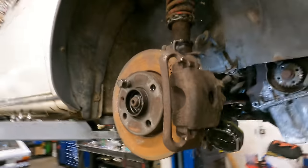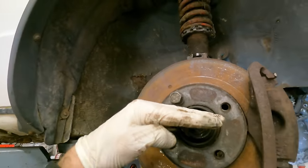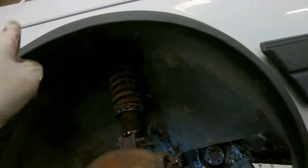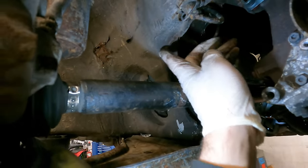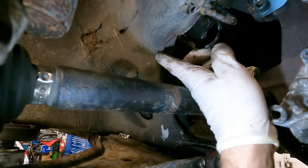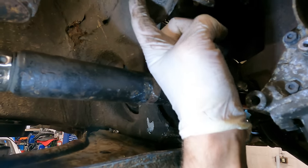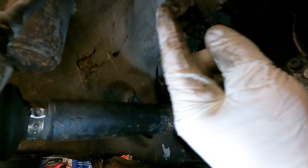Because we're going on air ride, when it's static this hub is going to be right up here and the wheel is going to be right up in the arch when it's parked, which means it's obviously going to hit there. So what we do is put a notch in it — kind of where that circle is, we just make a bigger one up and then plate it in. Sometimes we move this over.